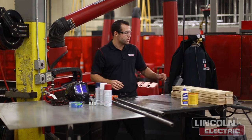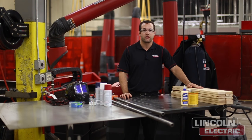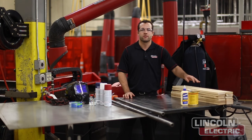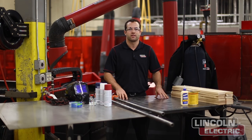While that's all drying we're going to be gluing up our wood base. We're using a 1x4 plank of wood — about 12 of them, all about 28 inches long. We're going to wood glue them all together and then finish them in a nice dark stain.